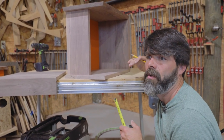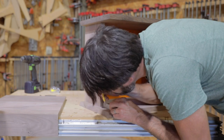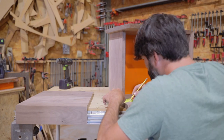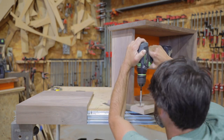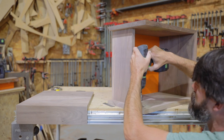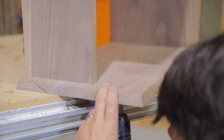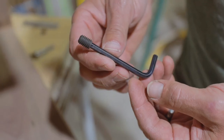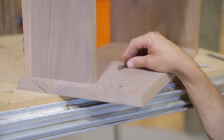We're going to start with very small divots. This is why we have multiple bearings: start with small divots, and as probably necessary, we're going to have to shift those divots just a little bit, at which point we move up to larger bearings. Make sure the bottom mark and the top mark are completely consistent and in line. Drill going down just till the tip shows, then pop it coming up so you don't blow it out. Make a very small divot on the top, use your tap, and thread the hole.